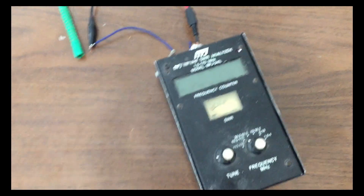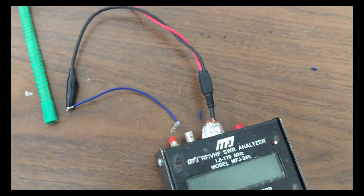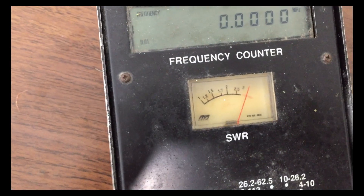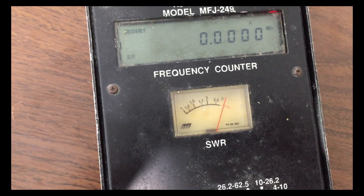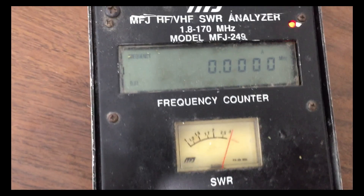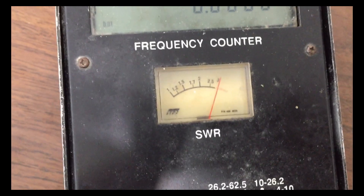So the meter here injects RF at 100 megahertz roughly into this coil. I'm going to turn this on now, put this far away to start. So this is just a transmitter, high-Q. We turn this on. You will notice the meter goes really almost into the red because right now it's a high reflective power — it's high-Q, so a lot of that is being reflected. It's detecting a reflection state, which is expected for a high-Q. Now in RF systems, this would be very bad because it means the transmitter is getting inductive kickbacks and wouldn't be able to sustain this for very long. But for the sake of the experiment, it's good enough as an indicator.